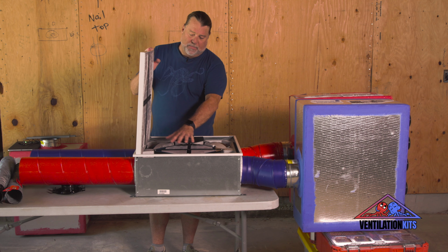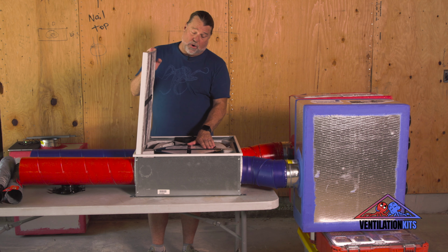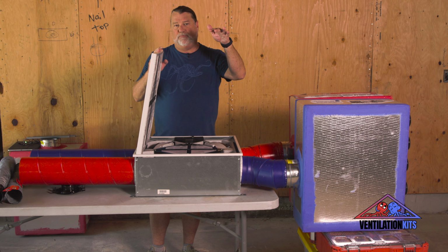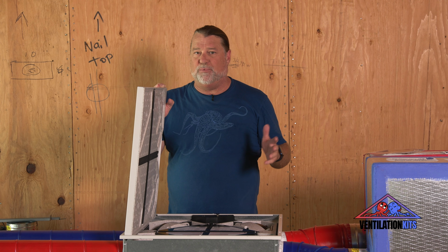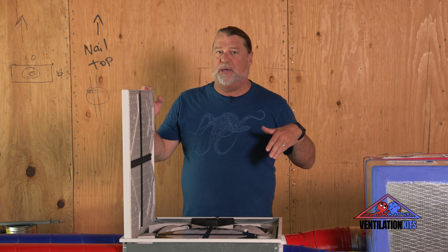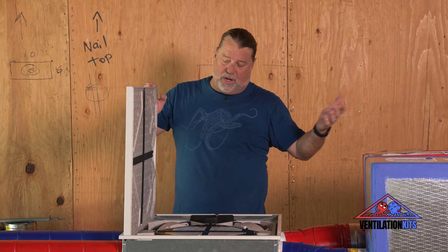So what happens in the core is the warm air as it's exhausted out of the house catches on the core, and the cool air that comes from the outside crosses another pathway of that core and warms that air all the way from 40. It left at 70, came in at 40, brings it all the way up to 67. So you're losing only 3 degrees in that air change. And that's why they call it an energy recovery ventilator, because you're recovering that energy before it goes out of the house. If you didn't, then you'd just be bringing in this cold air all the time, and that would be an energy penalty because the heater would have to kick on, and now we're spending energy on the heater, which is not what we want to do.